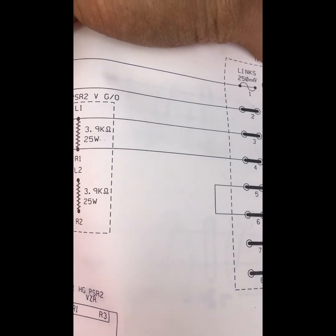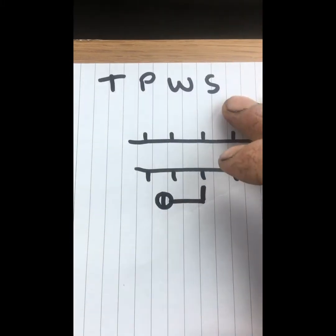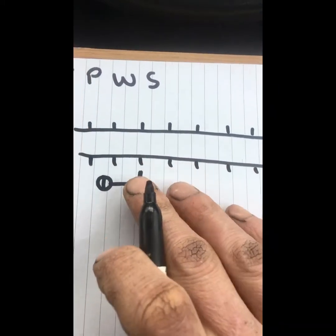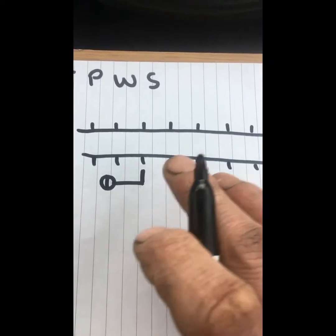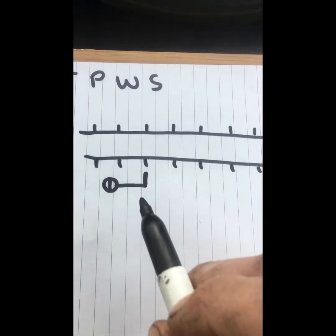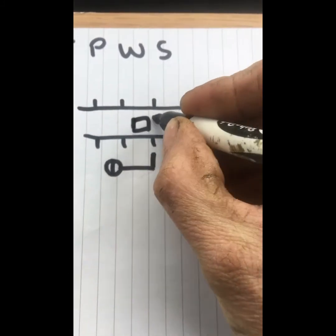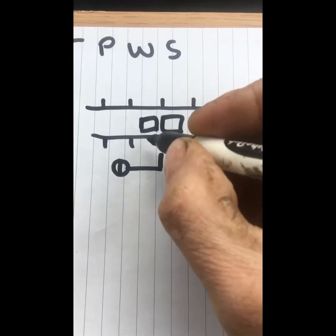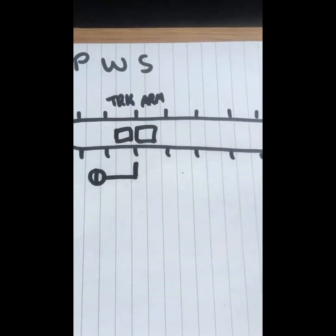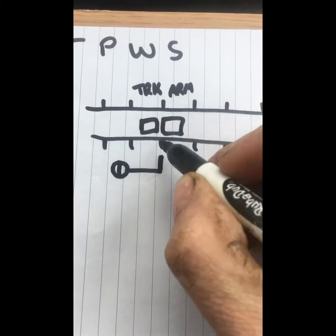You have your main power in on the top two lines, and the next two lines down drive the main input for the module itself. As regards TPWS basics, the system is designed not to stop a signal being passed at danger, but to mitigate the circumstances of a signal passed at danger by bringing the train to a controlled stop within a defined limit. The basic system has a pair of loops at the signal at a defined distance either side of the centre line. The direction of traffic on this track is from right to left. If the signal is at red, these loops would be energised and would bring the train to a stand if it tried to pass them.